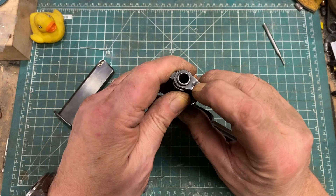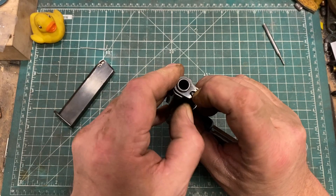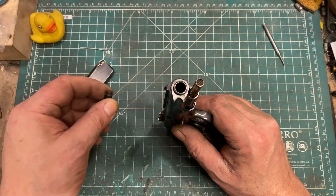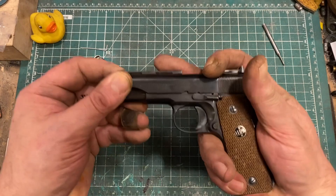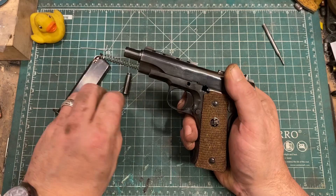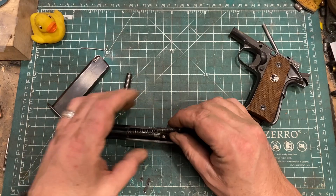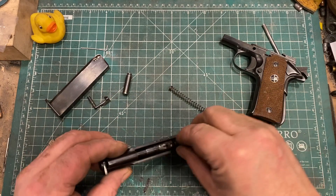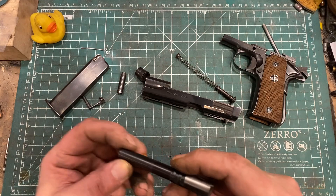Takedown is exactly like a 1911. You push in the recoil cap, rotate the bushing, and do not release the recoil cap — because unlike on the Colts, there is no little retention feature here to engage with the spring and keep it in place. It will shoot across the room. After that, it's simply a matter of lining up the notches, popping out the slide stop, and running the slide forward off the frame. You can see it has the partial recoil guide rod, very like a conventional 1911. And they actually even kept the falling link mechanism and dual locking lugs of the 1911.